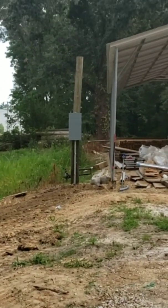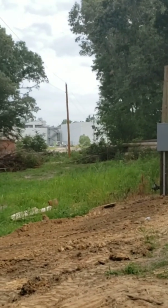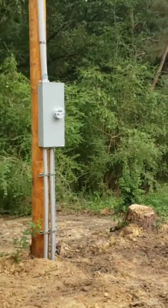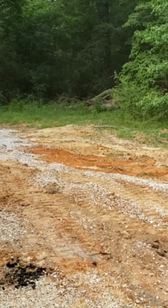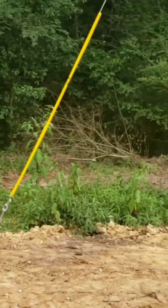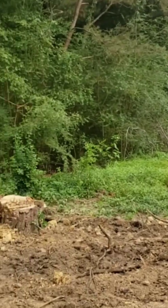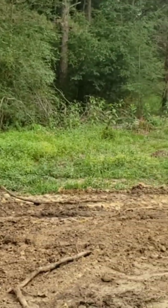and then they went over yonder. Now, what they did do for us, which I thought was pretty nice of them, is here, and there we didn't use big enough grounding wire, the bare copper wire. They wanted a number 4, I believe. Ours was a size under, and they said they would rather have the number 4, and they left the wire for us there. So I thought that was nice of them.